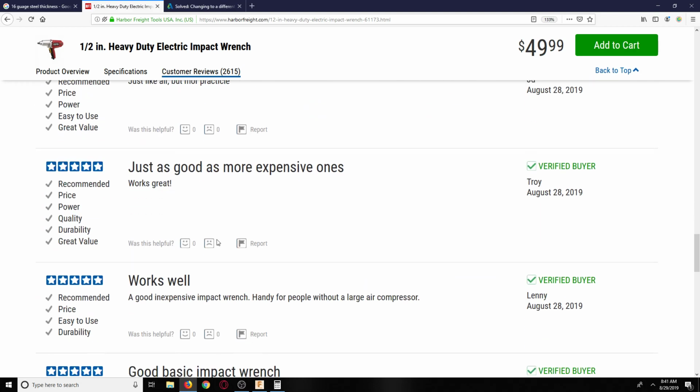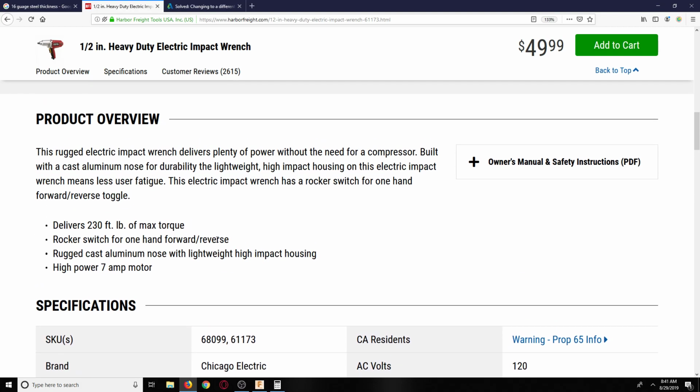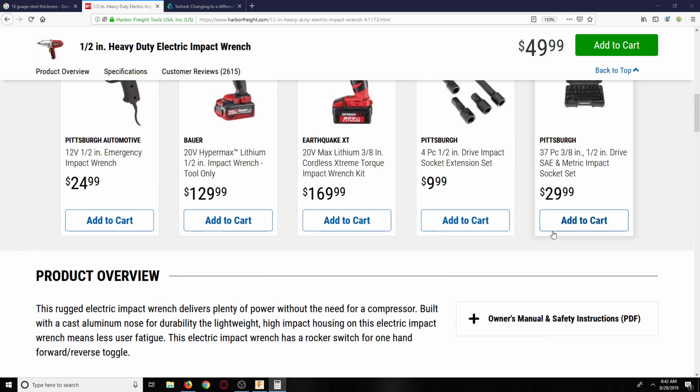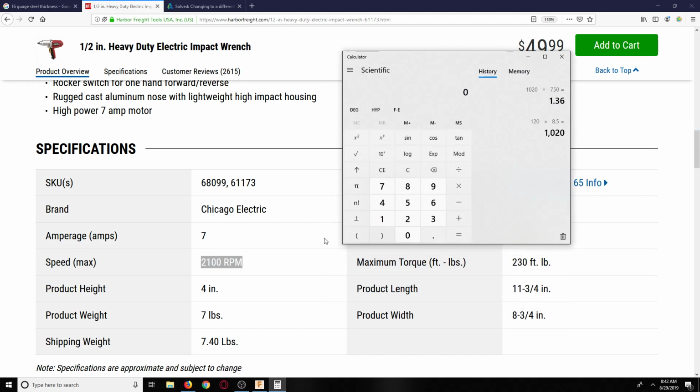And again, I don't want the whole impact part, because basically it's gonna try to rip this thing apart, right? That jiving is gonna try to break this thing. And so definitely want to drop the RPM down. So I'm thinking from 2100 down to 80, and then also I want to add a little tunable speed guy. So let's see, 2100 down to like 80 divided by 2100.